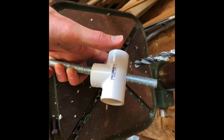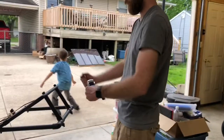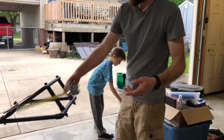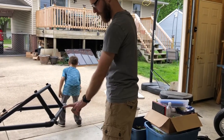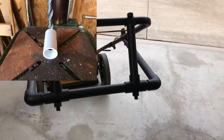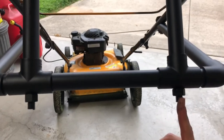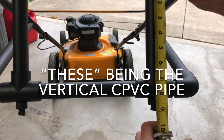What I've done is run half-inch all-thread rod top to bottom, drilled a hole in these PVC Ts. I had considered just leaving him with the bar here where he could do a pistol grip, but it still looked kind of goofy and wasn't ideal — it was going to put all the stress right there on the nuts. So 15 and a quarter to 15 and a half on your two sides, three-quarter elbow, three-quarter elbow, and a three-quarter straight T times two. If you've got a drill press — which not everybody does, but it'll make things a lot easier and a lot safer — all I did was put both of these Ts on my drill press and straight through. These were cut center to center six and three-quarter.